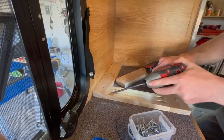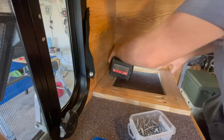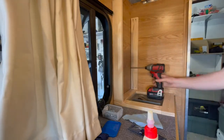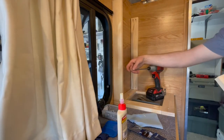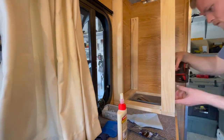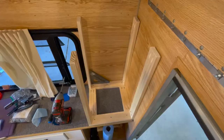And to build the cabinets, we used 1x3s for the framing, and then we used pocket holes and wood glue to join them all together. The purpose of these cabinets isn't really to hold that much weight, more just storage and organization, so we weren't too worried about it being a perfect build, but we wanted something that looked seamless and matched everything pretty well.